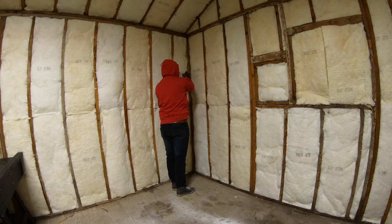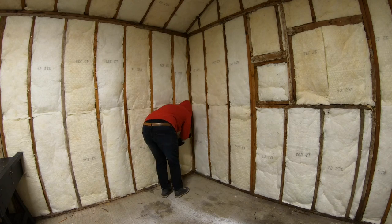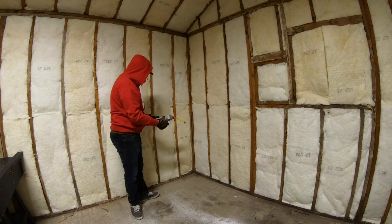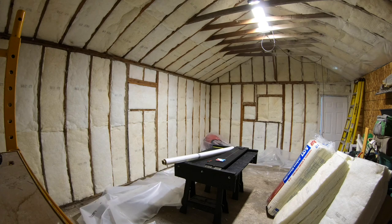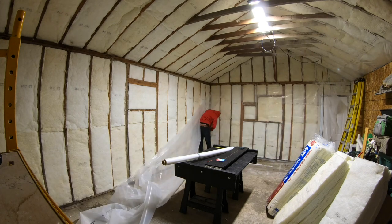There was a hollow corner here, so I'm filling it with foam. I'm just gonna spray that inside, let it expand, and I'm gonna run some acoustical sealant on all other inside corners and where the concrete meets the bottom plates. This is very important: also bead all the laminated wood pieces, like where the windows are, the jacks. Every space between has to be filled with acoustical sealant.